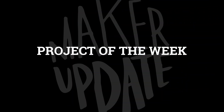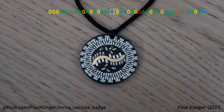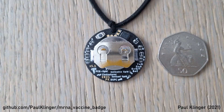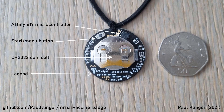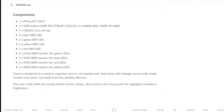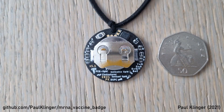I'm not about to screw up the formula this time, so let's get started with the project of the week. Check out this PCB badge by Paul Klinger. The front shows a schematic of the mRNA vaccine nanoparticle. At the center, a series of LEDs blink out the RNA sequence of the Moderna vaccine, but a long press of the button on the back will switch the sequence to the Pfizer vaccine. The back is also where you'll find the coin cell battery, an ATtiny microcontroller, and a little key to the biological elements in the schematic and the LED colors. Paul has the code, PCB files, and bill of materials all posted on a GitHub link in the description. It's a great little project and a literal badge of honor for a scientific achievement that is saving lives around the world.